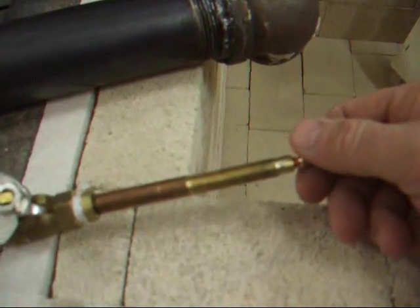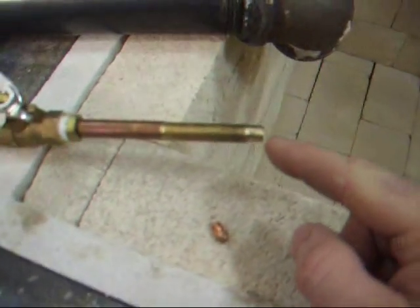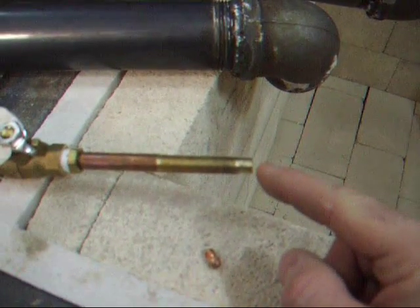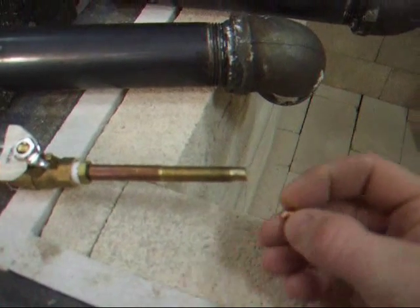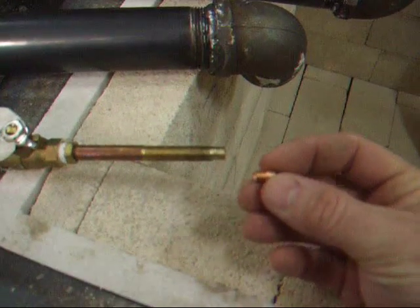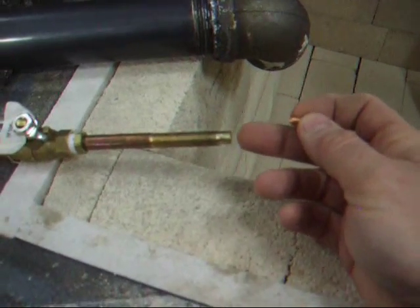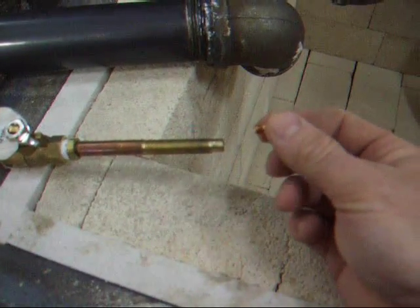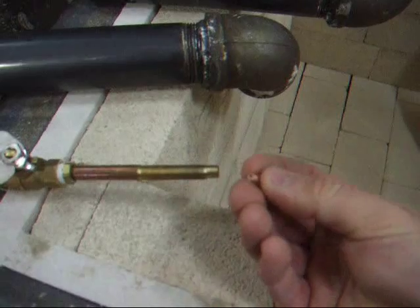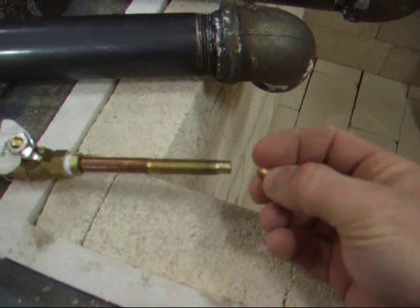The other thing I did was I soldered a nut on the end — you can't even see it because it's soldered brass to brass. I soldered a nut on the end and then re-tapped it to fit a MIG welding tip. So I bought a 10-pack of MIG welding tips and re-tapped the nut for the correct thread, which is metric. What that does is it gives me the ability to unscrew this quickly and put a different orifice in and change orifices as I go.